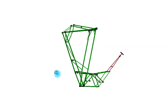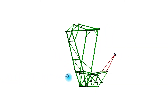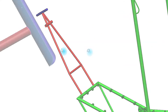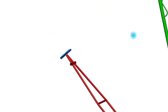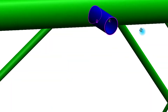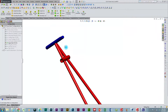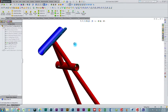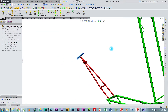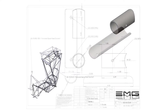So far, we've completed the frame to this stage. Shown in green is the fuselage frame progress so far, and shown in red is the instrument panel bulkhead assembly that was installed in the previous video. Shown in blue are the two components we're going to weld to the frame in this video: the upper tube 5310-22, which is the forward spar keel socket, and the keel pocket 5310-08-100. Both of these parts will have to be manufactured before we can begin the positioning and welding of the upper keel.